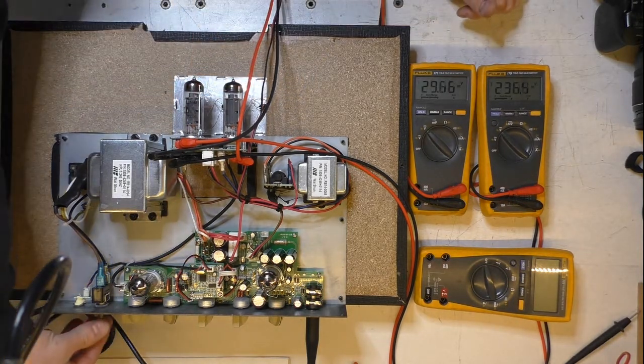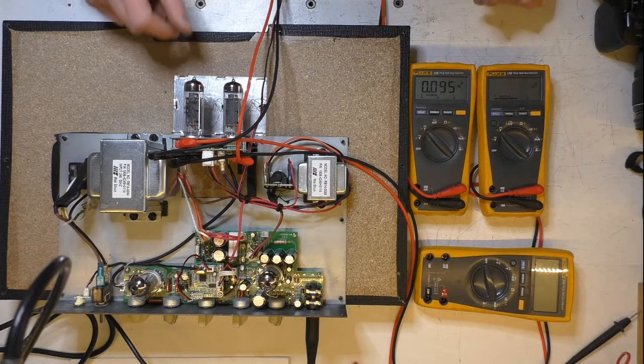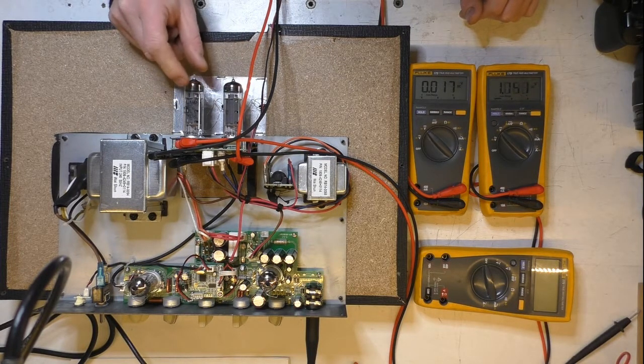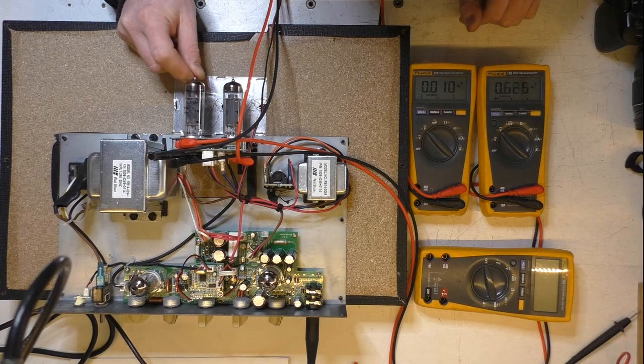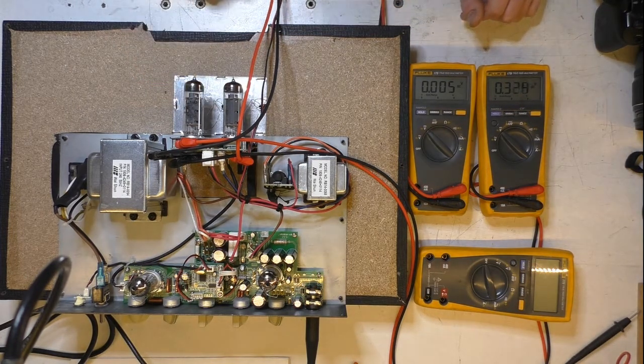Look at that, 30 volts. Turn that off before it does damage. Yeah, so there you go. It did it with the mildest tap before, so yeah, something inside the valves on the way out, because the connections are fine. Wiggling them around didn't change it, just a bit of tapping is what caused it to fail.